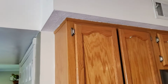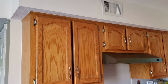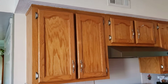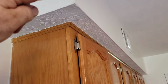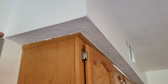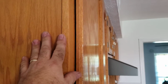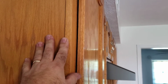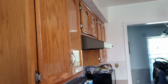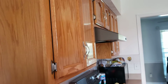Make sure that when we're looking at replacing these cabinets, it's going to be like for like on these measurements, 30 inches wide. But one thing we did talk about is this is an unusual depth. This is 15 inches deep front to back on the soffit. So you've got room here to make these cabinets 13 or 14 inches deep without any problem at all, and that would really make the storage area around this a lot better for this side of the kitchen.